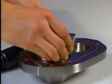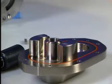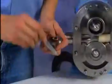After removal, place the rotors on a rubber mat or place the rotors hub down to avoid damage to the rotor wings and front rotor hub outside diameter. Remove and discard the rotor hub O-ring and rotor nut O-rings.